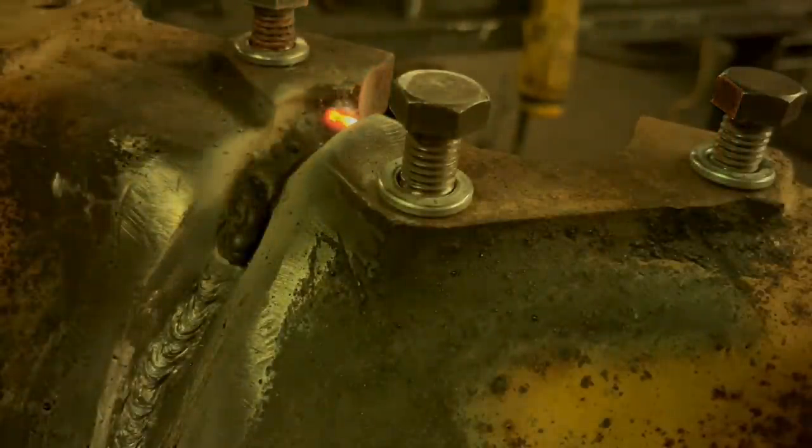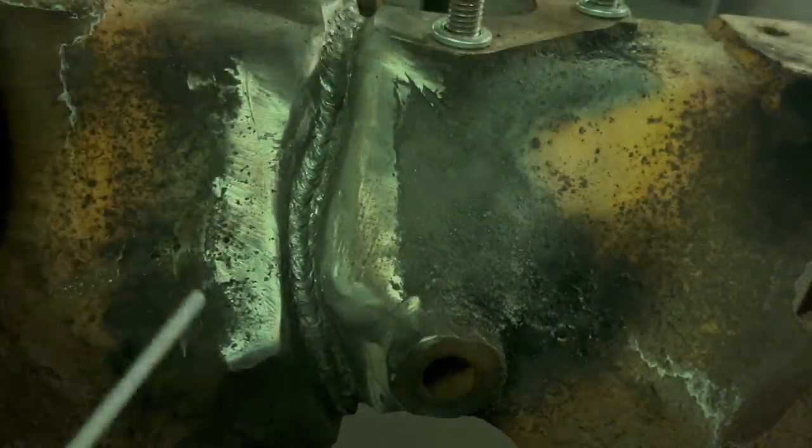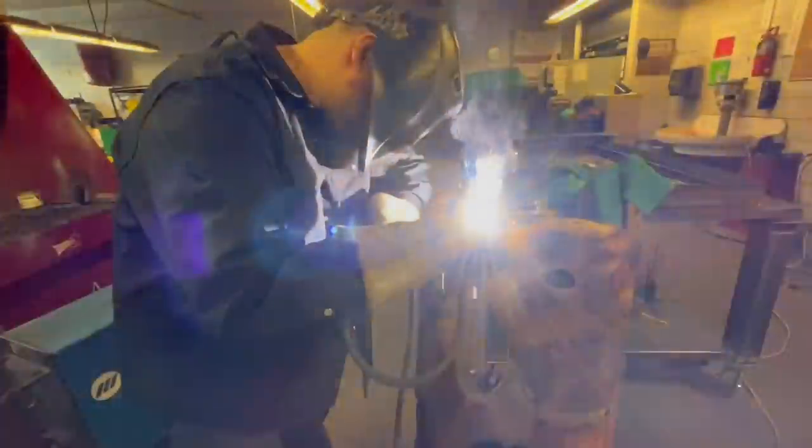After completing the root weld, I start to stack beads accordingly to fill out the V. I'm starting at the bottom and working my way out, laying stringer beads, stacking them into this V so I don't leave any voids or lack of fusion. I want to put as much metal in that groove as I possibly can and make it as sound as possible. Sticking with stringers is a good idea — when guys start getting really wide weaves, you open yourself up to more problems. Take a few stringers, take your time, and pay attention to stacking welds without any voids.